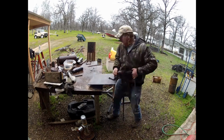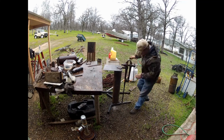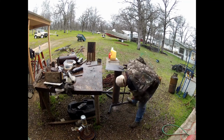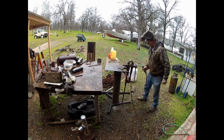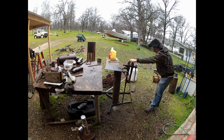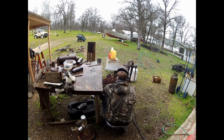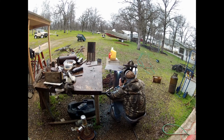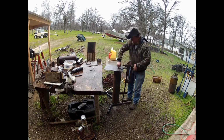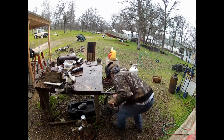My post, the well casing, is actually a little bit short, not too bad. It makes the table kick out a little bit on the far side, so it's kind of sloped. I just welded it in at the angle. It's maybe 3/16 of an inch on the 6.5 inch diameter of the pipe. I just filled the gap, tightened it down, welded it down.